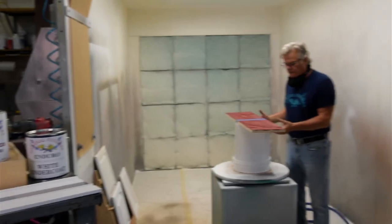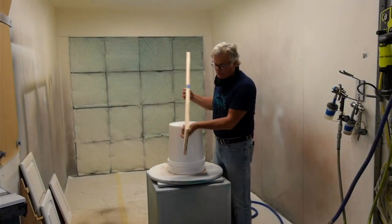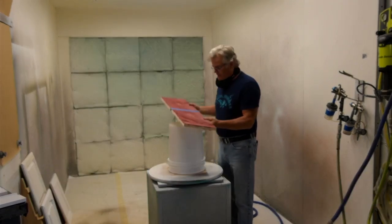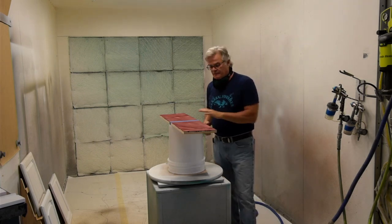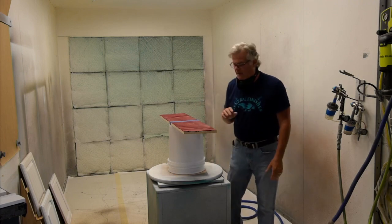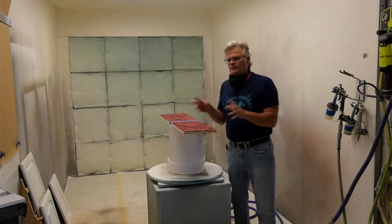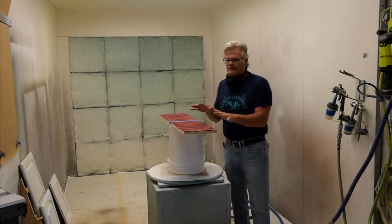So this is a pine board, and I grabbed this board on purpose, because of the knots, the big giant knots. People are wanting to paint pine furniture and paint cabinetry, and to hide the knot. But I want to demonstrate why stain blocking primer becomes a critical point, because it'll help stop the bleed through.